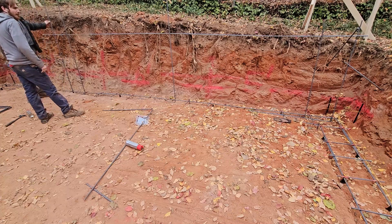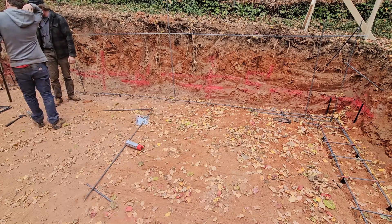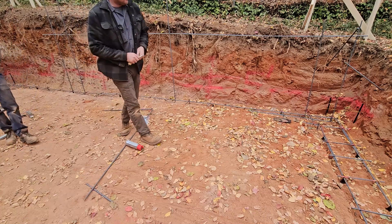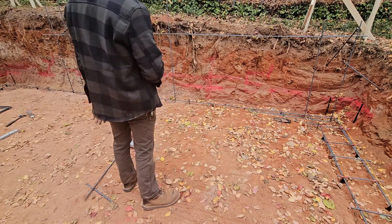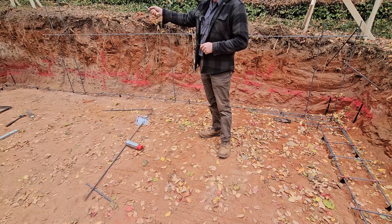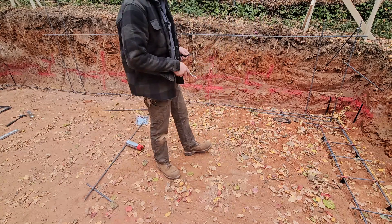We keep it pretty thin and can just simply put them all in and lay them against it — one side, then the other — and that'll help hold. We'll probably add another one in the middle since we have a scrap piece long enough. Every 16 inches there'll be another one of those pieces, all the way around, down through the other side. Next we'll have to show you when we get over to the far ends, where we have to do some rebar up and over for the higher footers where the crawl space section will be.